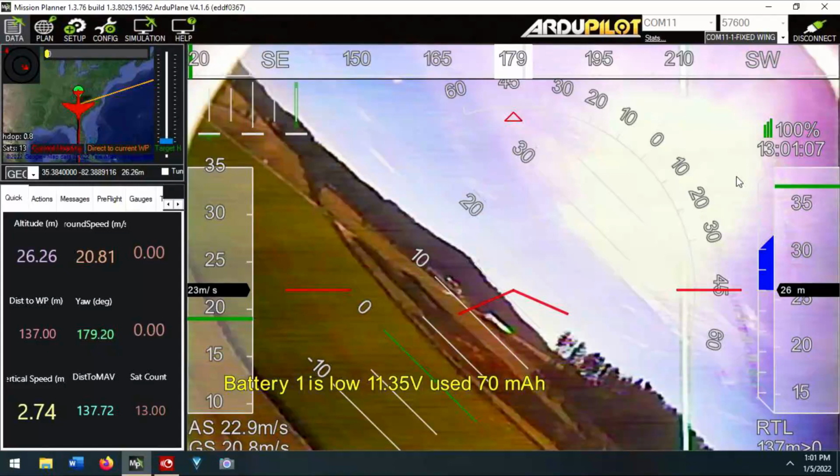Oh, crap, I forgot. That video transmitter would have been on at that time, too. And that could suck it, although it's on 25 milliwatts, I believe. I haven't messed with changing the power on it yet. Well, so there's a good reason to set it on a USB cable to lock satellites rather than a flight battery, because in 13 minutes, with the video transmitter running, everything that's running in this, even though the flight motor's not running, I would suppose it could pull down the battery over a volt.